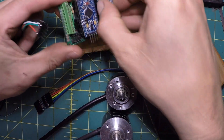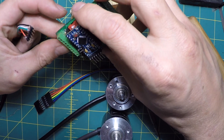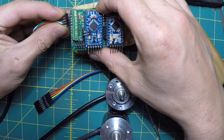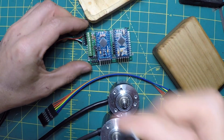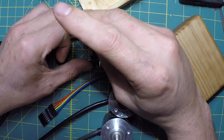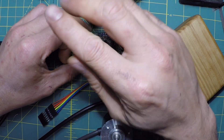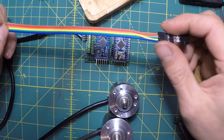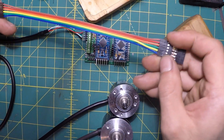I need to get the orientation right here — positives go down. This rotary encoder requires pull-up resistors. I found that the OLED display driver board uses too much of the I2C bandwidth, so it's going to be communicated with using a serial cable from now on. I made this here — you can see the RX and TX pins are reversed.